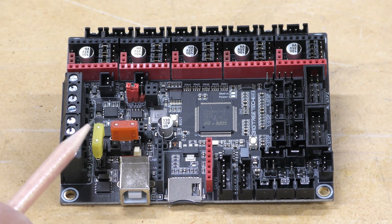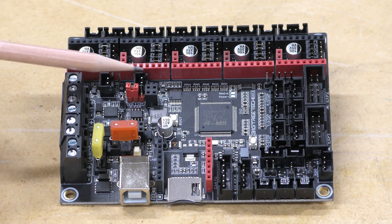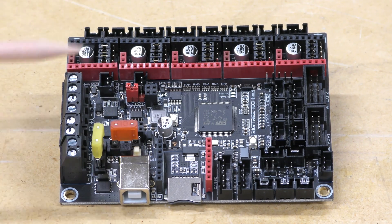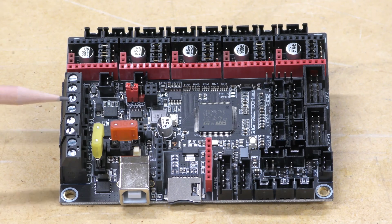Right here we do have two fuses for the board. Now these are the different power connectors: this is for the heated bed, this is for the power input which can be 12 or 24 volts, and these are for your different hot ends — hot end one and hot end two, again for dual extruder. These right here are the different fan connectors: fan zero, one, and two. All these are controllable through the software, which is very nice. There's also a plug right here — if you add a module to this, you can tell it to run 5 or 12 volts for all three fans at the same time.